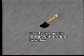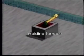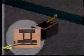The pump is great for use in the low-pressure green sand casting process. The pump and heated launder are immersed in a holding furnace and deliver metal to the bottom side of molds produced by a vertically parted green sand molding machine.